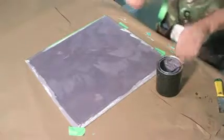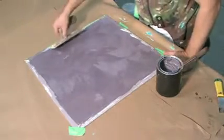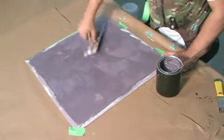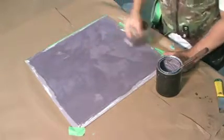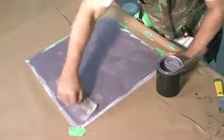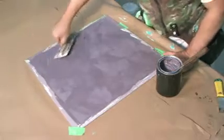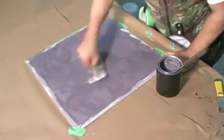Our acrylic Venetian plaster can be installed in a variety of different techniques, and a feature unique to our product is that it can be machine polished using fine sandpaper 320 or higher. This will produce a very smooth finish with a high sheen level while cutting out the task of trowel polishing.